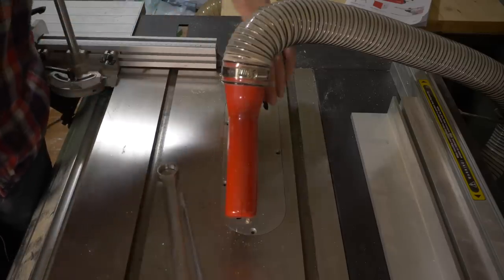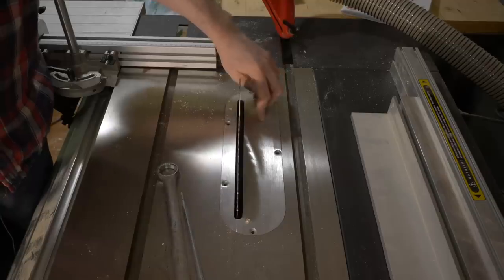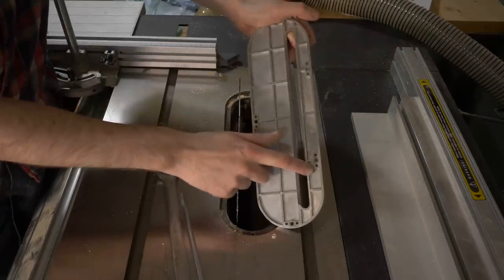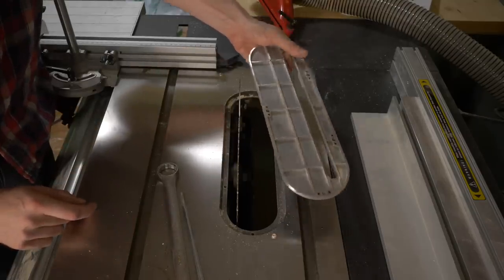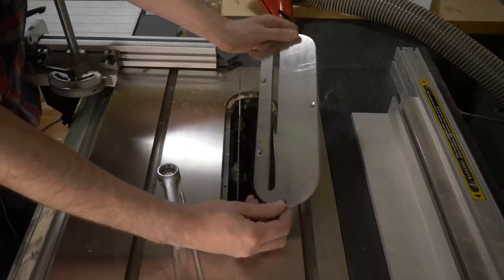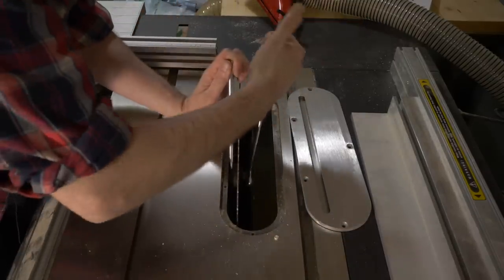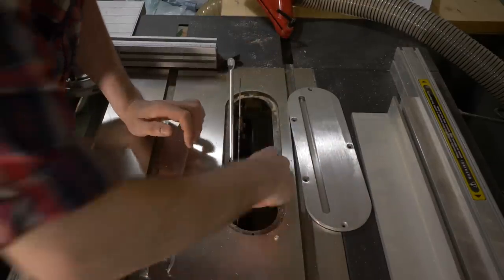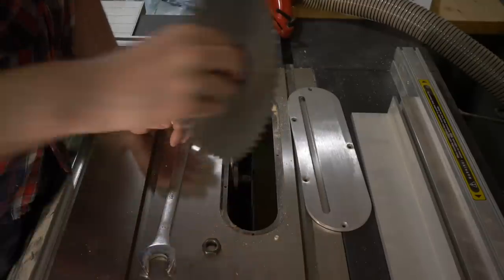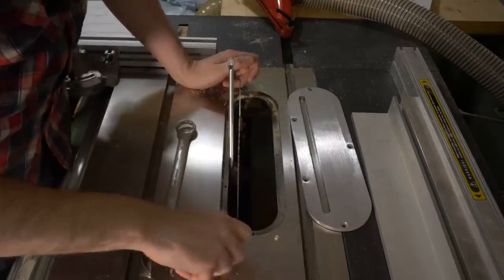Someone wanted to know what the blade change is like - it's pretty simple. The crown guard just comes off with a few twists. There are five screws to hold the insert down but I haven't been using them so you can just pull it out easily. The insert has grub screws all round so you can get it perfectly level, which is nice. They sell a zero-clearance insert with a smaller slot, but it's a very simple shape with no complex locking mechanism so you could easily make your own. There's no spindle lock - you just drop in the bar, put the spanner on, and loosen. It's got a reasonably good length of spindle and blade changes are very simple.